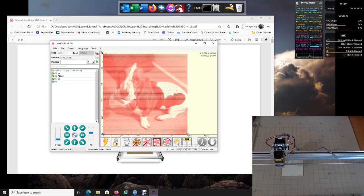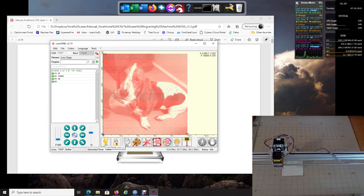Turn the laser back off for now. Your frame represents the size of your picture. Right now wherever your machine is at is where the software thinks zero-zero is. If you move your machine over to where you want it, click the first arrow — it resets to zero. The plus sign shows where the software thinks your laser is.